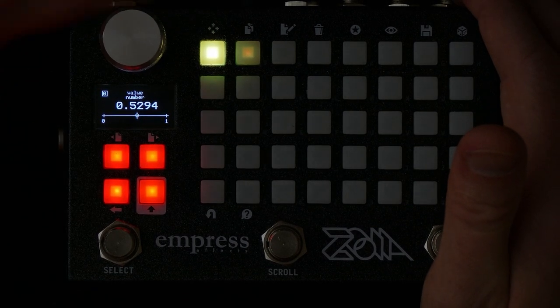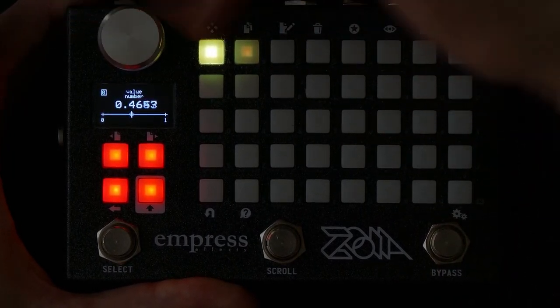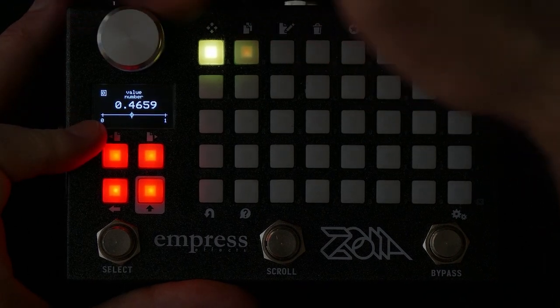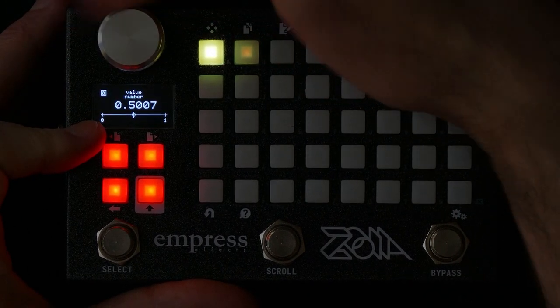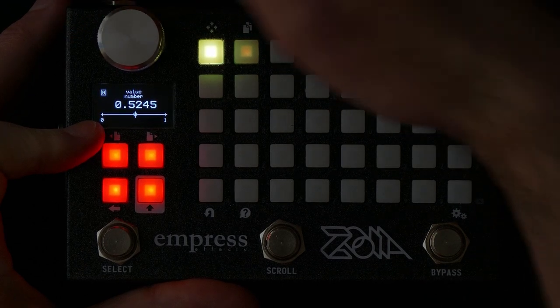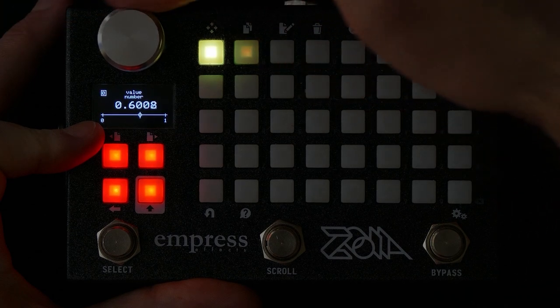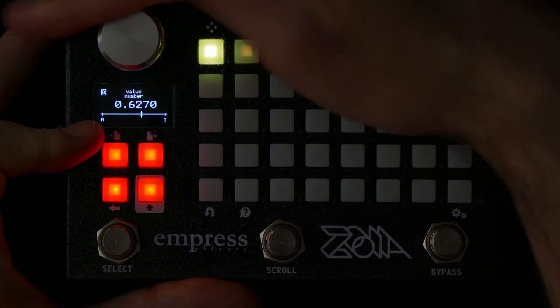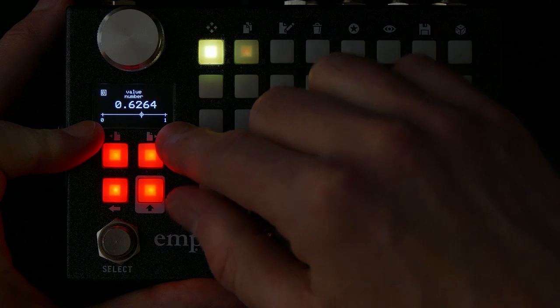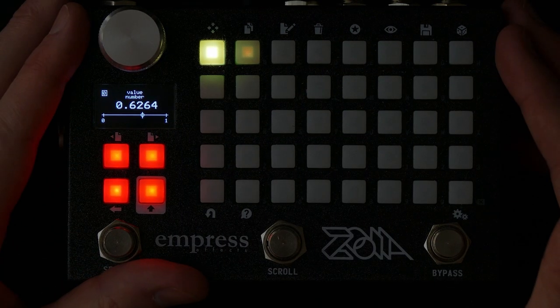Another thing that seems to happen more easily with the new encoder behavior is that if you try to move it very slowly, sometimes it actually jumps down in value — it's almost like it bounces back. If you do it a little bit faster it is more reliable, but once you go a little bit too fast it will bounce back. This behavior is of course not ideal at all.